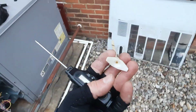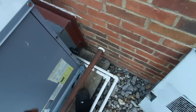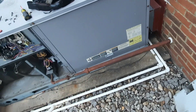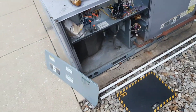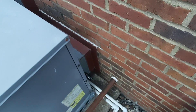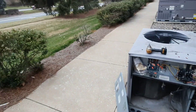I found a bunch of butterfly dampers and all of them were closed because they had hot and cold spots - the thermostat's out in the main hallway and they've got offices on each side. I opened all the main space butterfly dampers at the registers, then cracked the office ones open just a little bit. I was running 122 on my supply, which is going to put me about 50 degrees of rise instead of the 60 to 65 I was running. Don't just run off and leave these things. If all of this had been done right in the first place, none of this stuff should have happened. But it is what it is - that's the game we play most of the time. Happy New Year guys.